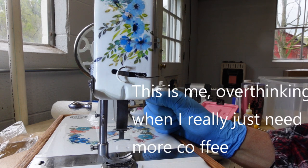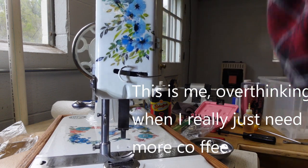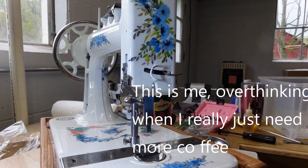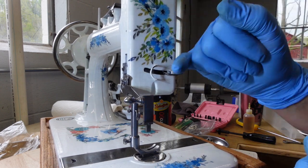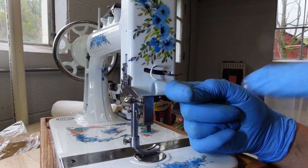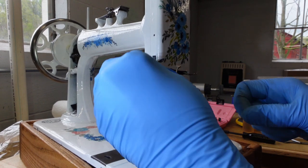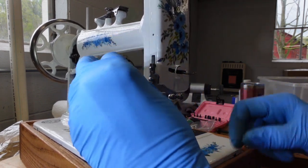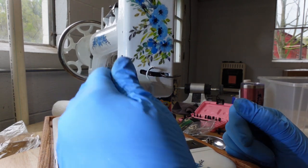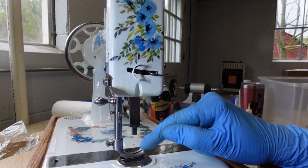And unfortunately, I can't adjust that until I take this off again. Okay. Actually, before I take it off, I'm just thinking, there wasn't a way to adjust the presser foot height because there was a set hole that the other part of this little block screwed into, you know? There wasn't a clamp that had any give. It was just one set hole. I think that on this machine, all you can do is adjust the feed dog height.